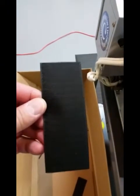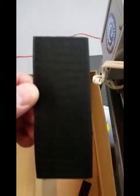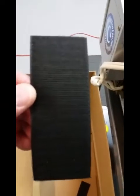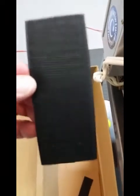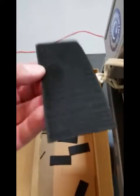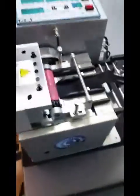Now, there are some fine-tune adjustments you have to make digitally on the machine. You have a millimeter setting and you have an inch setting, tenths of inches and hundredths of millimeters, so you have some options on the machine. But it does do very straight cutting, very controlled cutting, and it's completely digital. And there you have it, HC-530.